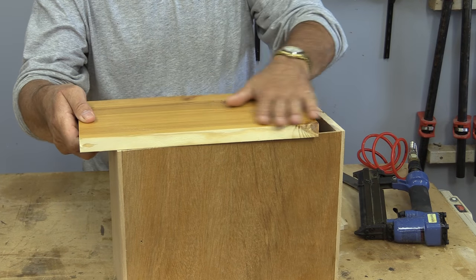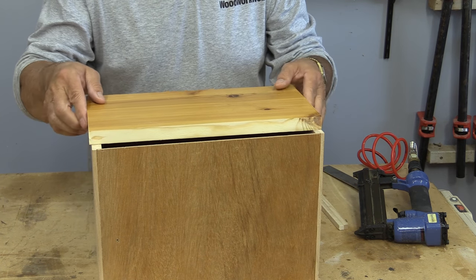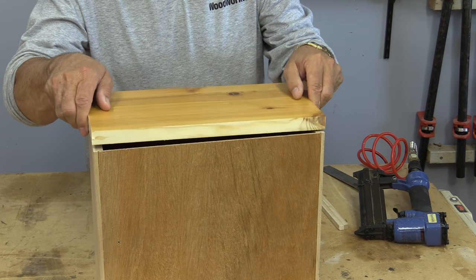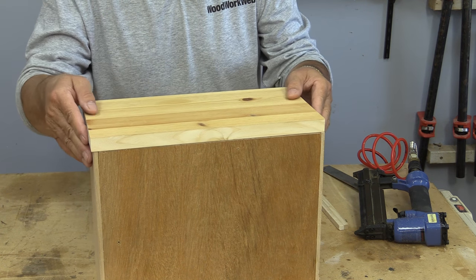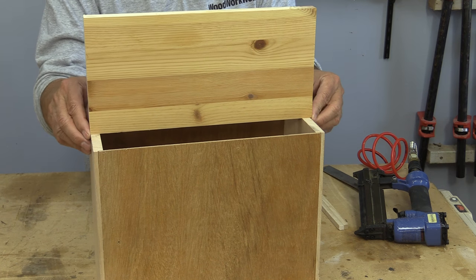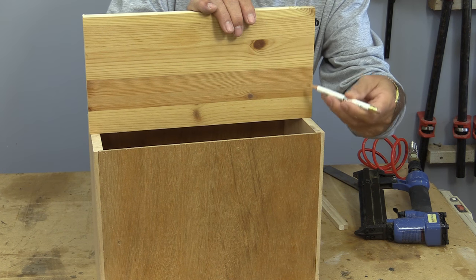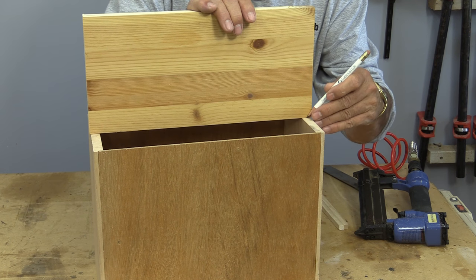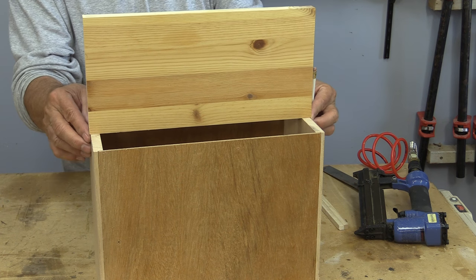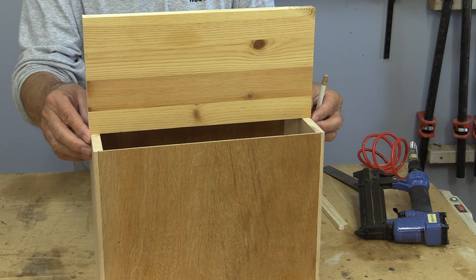I found another piece of wood and I can see that it was varnished on one side at one time. I want this lid to be able to drop on here — I'm going to put this side up. Where I want to cut is a rabbet on each side, so I need to go from the inside here to the outside, and I've measured that and it's about a half an inch, and I'm going to do that on the table saw.